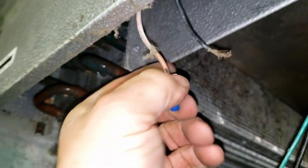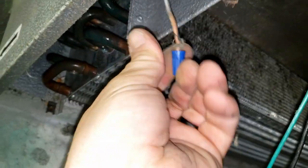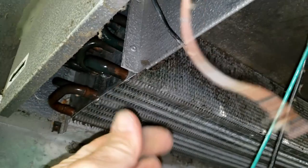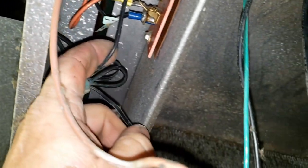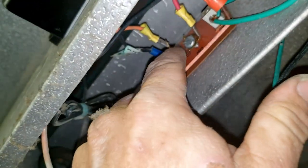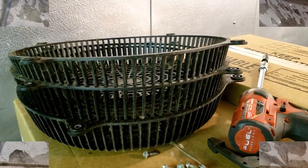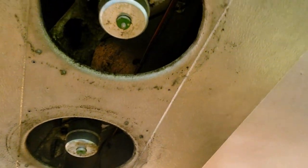I think I found something - this wire looked really corroded. It had been getting down in the pan and getting wet, and they've got an undersized wire nut on there. We're going to restrip that - it goes up to the thermostat. It'd be nice if they'd just run it directly to the thermostat instead of using these hodgepodge connector wires in between. We've got the motor terminals hooked back on, and we'll clean those up and we should have good airflow when we're done.